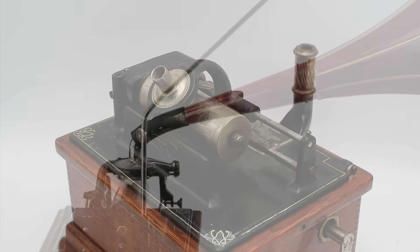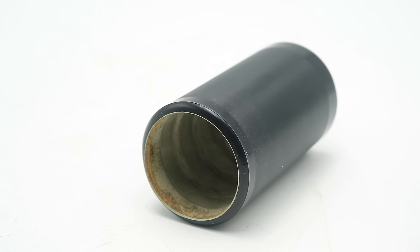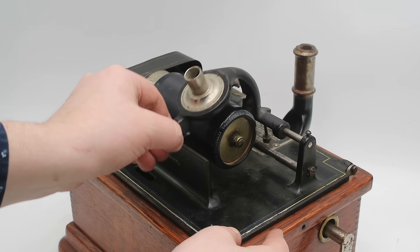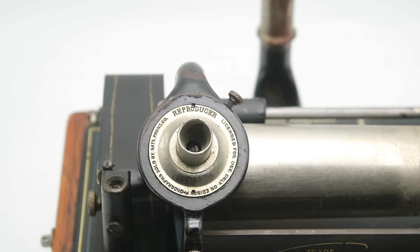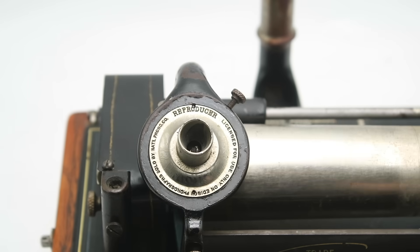The horn attached to the reproducer via a short piece of rubber tubing. The mandrel for mounting the wax cylinder slips on with a tapered interior so it can only fit in one direction. The mandrel is driven by the clockwork motor via a belt and pulley. Over the mandrel is the playback arm and reproducer, which holds the jewel stylus and flexible diaphragm that translates the hills and dales in the record groove into sound. The set screw normally allows removal, but this example is stuck fast, so I'll leave it in place.